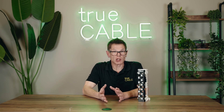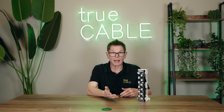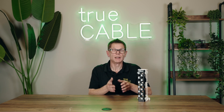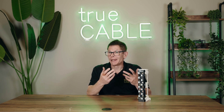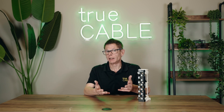Wall mount patch panels can be put essentially anywhere — you can mount them on drywall or directly to a backboard. It's only 12 port, so you don't need a floor-standing rack. The big advantage of patch panels is they organize your structured cabling into one spot. You can label them and terminate your cable to keystone jacks, also known as IDC-style terminations, which are far superior to terminating everything to RJ45 plugs — something you really don't want to do with solid copper Ethernet. The patch panel helps you obtain high performance, keeps you organized and structured, and makes your installation easier to troubleshoot and expand in the future.